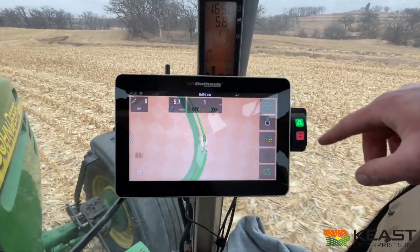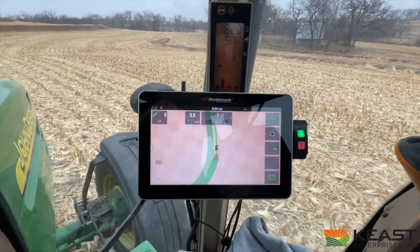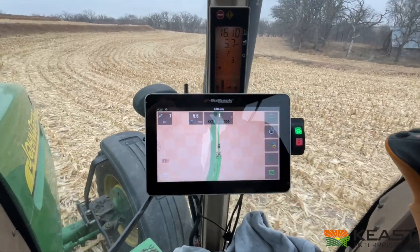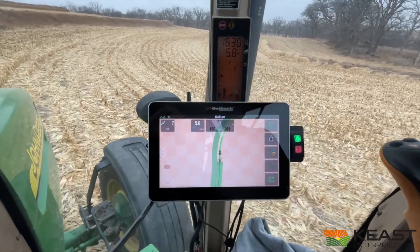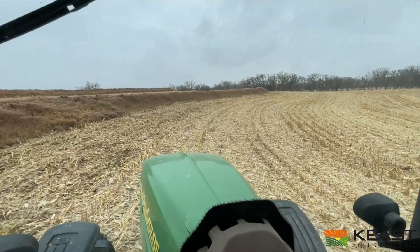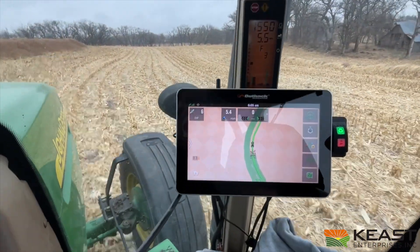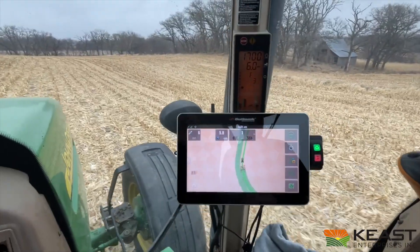The green button on the right side is the full system power. Pressing it supplies power to the ESI2 wheel. This is wired direct to the battery, fused for 10 amps. I didn't want to hook it into the power strip on the tractor — I wanted to run it straight to the battery so it's not on key power. So when the system needs to be shut off for the night, you've got to turn it off with that rocker switch. The boot-up is really fast — faster than the tractor building temperature on cold mornings. You've already got correction and everything up as soon as the tractor has temperature.